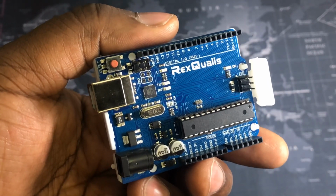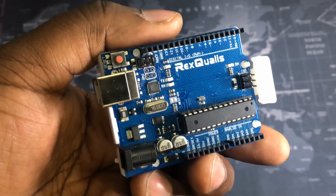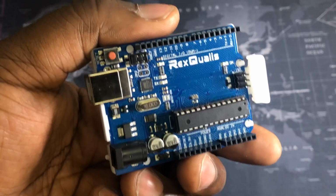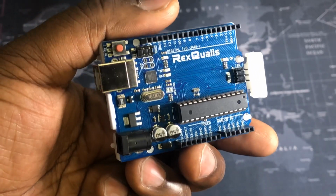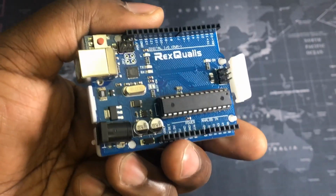Arduino is much simpler than that. All it does is run your code. So as soon as this boots up, it immediately starts to execute your code. So the startup is very negligible. It's almost instantaneous, which is great for when you want to run an application that's going to be powered in your car. So how can we power this in a car?